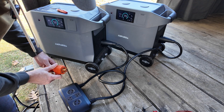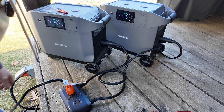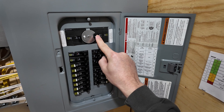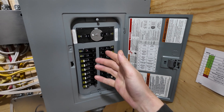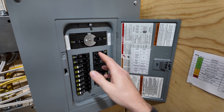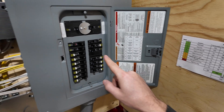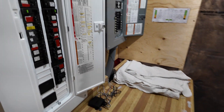Now I should just be able to plug in my generator cord. We're in — now run into the house. Once I flick this over, this side is grid and this is going to be the generator outlet. It does say 60 amps, but there's a 30-amp plug outside and those two units can't do more than 30 amps anyway. I do need to look into replacing this to a 30-amp plug. You can see all my different critical loads here that are on this manual transfer switch, so let's flick it over and see what happens.